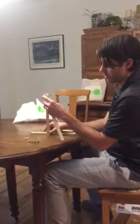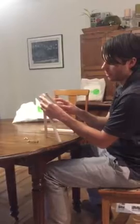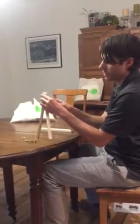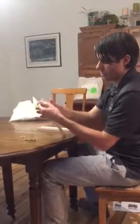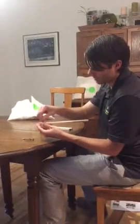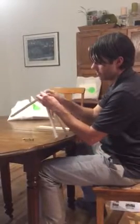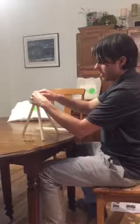And then finally through the piece of wood with the longer angle cut — that's the twin of the other outside support arm. So it's gonna look something like that. Thread it through, place the washer on first and then the wing nut, and secure the three pieces together so that they make a tripod.